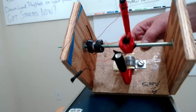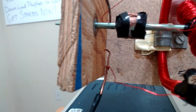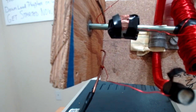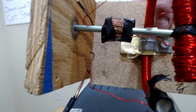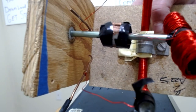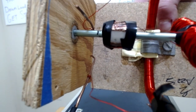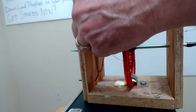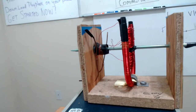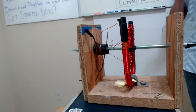The commutator is made with wires. You can buy copper tape at Home Depot and make a nice commutator — you don't have to use the ones shown in the instructions. That gap in the commutator is a huge gap — you don't have to have that big a gap. And the brush connections are not that good. You do want to use a stiffer wire for the brushes. Having consistent contact between the commutator and the brushes is important.